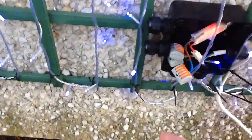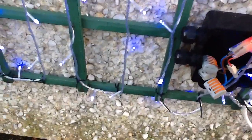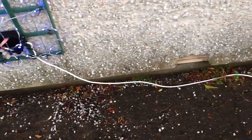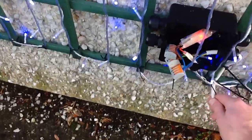Where I've run the lights in already, I left a bit of slack at the bottom here to allow for this to be pulled out if needs be, to give access to the junction box. I've run the cable in — the cable choice I'd rather have used black rubber cable because it's better rated for outdoor use, but in the Isle of Man you use what you can get. So a bit of strain relief there in case that gets pulled.